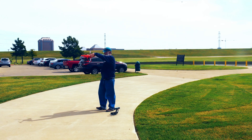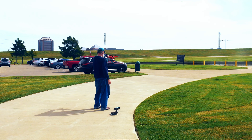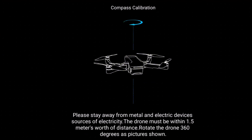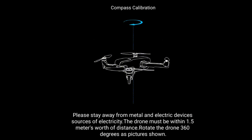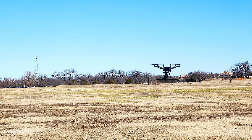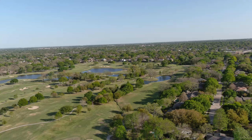For me, a gimbal calibration is very rarely needed. I think Autel drones tend to require that more often than any other drones, but really, that's just my experience. That's how I approach calibrations with my drones. Do the calibrations when you get a new drone or when you do firmware updates. Then look for unusual behavior in your flights. Now that you know what the toilet bowl pattern or the tilted horizon looks like, you'll recognize when your drone is telling you a calibration is needed.